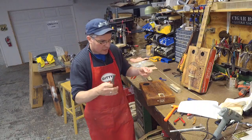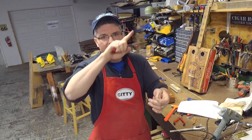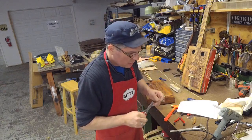And again, if you're just tuning in, these are special pliers for widening the fret tang. They give it more of a wave pattern, widen it, and make it stay down in the slot better.